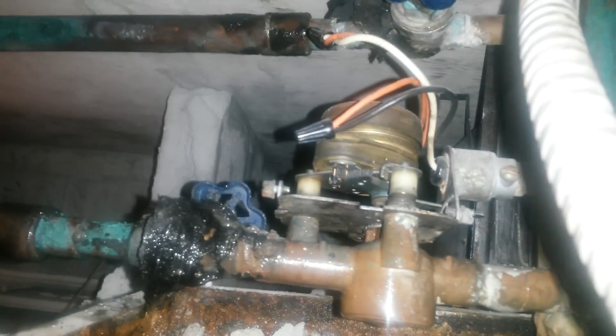This is a chiller, a fan coil chiller. We have to replace that valve because there's a big leak. Both of the shut-off valves — there's one there and the other one there, the ones with the blue handles. The one with the wires is the control valve — it's leaking, but none of them will close. So we have to freeze those lines, and to get access we have to cut an access hole in the closet so that we can work. If not, there would have been no way to work.